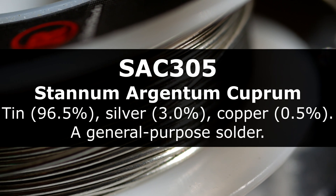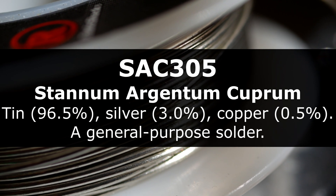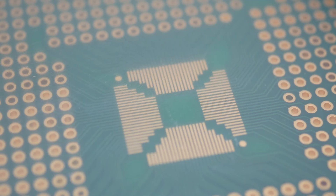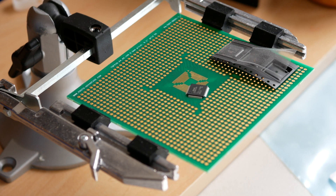I'll probably use it mostly for special occasions. Compared to my usual alloys, which are SAC 305 and 99% tin, indium has a very low melting point, high conductivity, and it remains relatively plastic in a solid state, even at cryogenically cold temperatures.